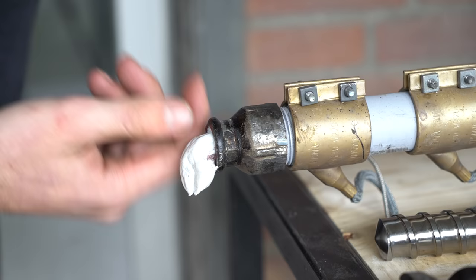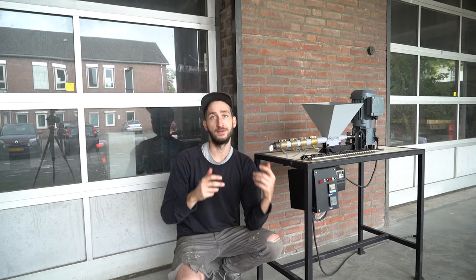One thing we also like to do is change the nozzle for the exact same one as we use in our injection machine, because the thread on the end makes it easy to swap molds on and off. So if you're extruding beams you can swap from one to the other to make the process quicker and set up a little production line.